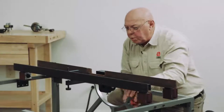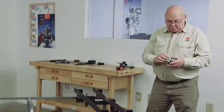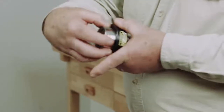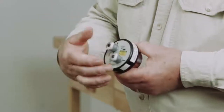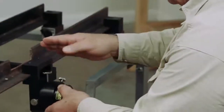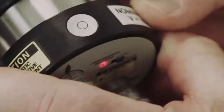The 706 goes in here. We have nominal settings on here — for the vertical, this being the vertical micrometer, and this is the horizontal micrometer. We set these at nominal settings, which brings that beam out reasonably square to this face or parallel to the ODs of these targets. There's a level on the top and also on the bottom. We want the top vertical up and the line up and down so the rating is correct. When we insert this in here, we push it in. We want this level from side to side — it may not be leveled front to back and we can't control that, but side to side we want it leveled, then tighten the thumb screw.